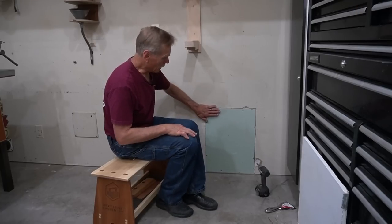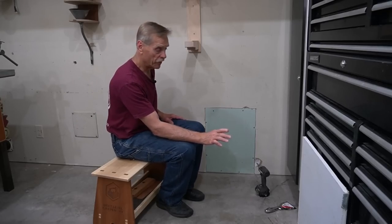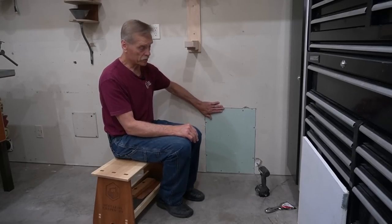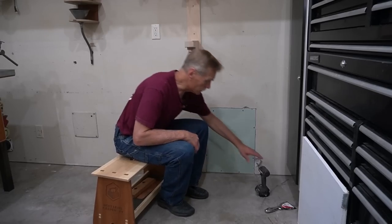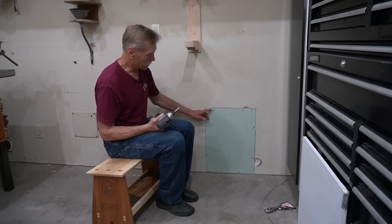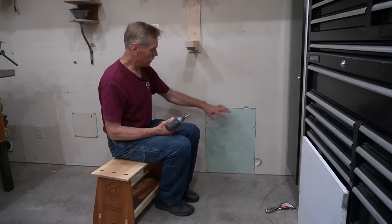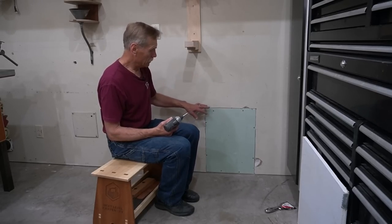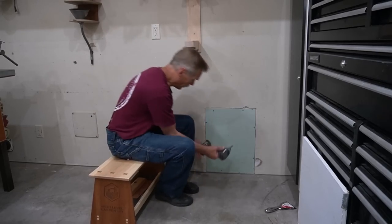This is just a piece of half-inch moisture-resistant sheetrock that I used to plug the hole until I could get a scrap of the 5/8 for the actual patch. I didn't shoot video of cutting the hole because this was quite some time back, but this is what a normal patch would look like — just cut with a decent small gap margin around the sides, and then that would be pre-filled and taped. But I'm going to pop this out, talk about the opening, and fit that piece to it.